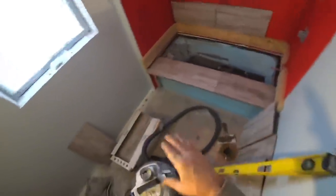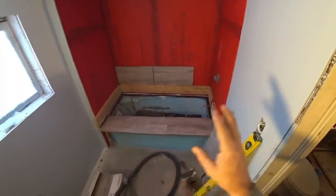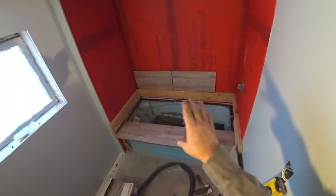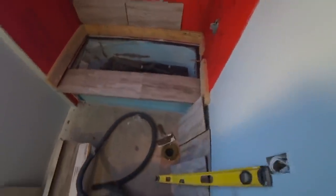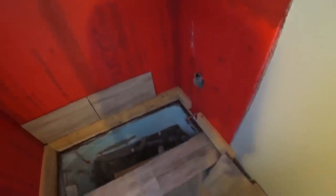I have laid all the tile out - the tiles have a pattern on them, and when you have patterned tile it's nice to lay them out and try to get a design flow working. It has kind of a wood-grainy granite texture look. I have them somewhat matched up to try to get it to flow from row to row so it looks like it's supposed to. They're all marked and numbered - all the short pieces are over here with numbers and which way they point, written in pencil which basically just washes off. I'm going to cut all the tile and have it all laid out in order.